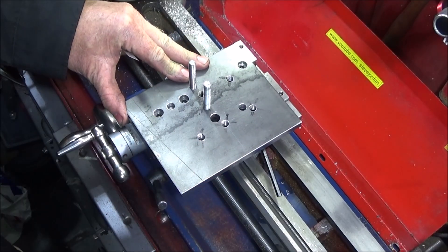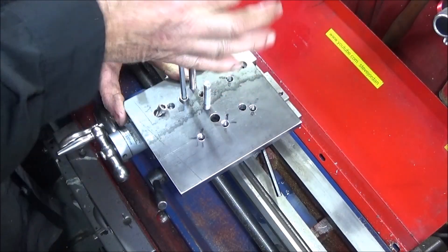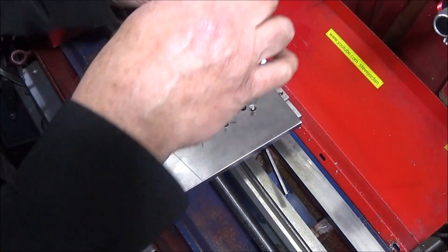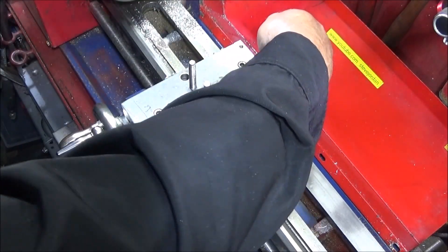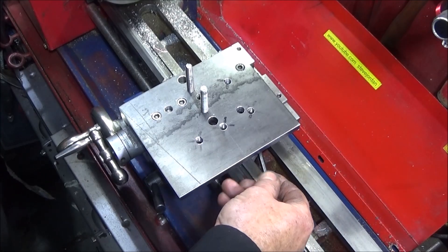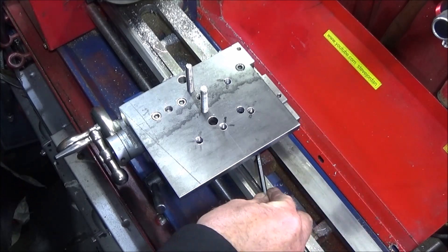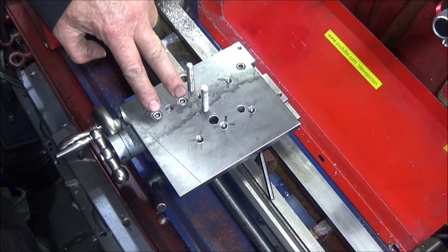So this one goes on like this, the two Allen bolts screw down into the swivel assembly as before, and then I position the pallet over that new threaded hole. I've cut one to length so that it actually doesn't hit the lead screw going through — I did drill mine with the lead screw in there but took great care not to clash with that. The carriage lock Allen key is held in place into the head of the Allen bolt and can't fall out because it can't lift up far enough to come out. That extra securing bolt makes the whole pallet look much better and I think it's much more secure than just having it locked on the two at the front.